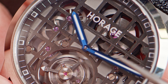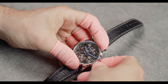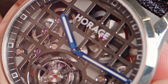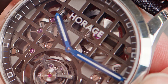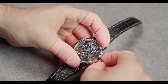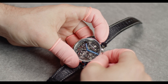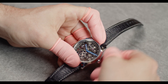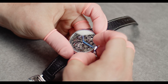Now the watch is fully wound and you can see that the mainspring will skip little gaps in the barrel. This prevents a breaking spring, which is quite unusual for hand-winding systems — only for automatic systems — but we did that because of the danger of breaking the mainspring. You can hear it, but it's not very noisy and you can feel it. When that happens, you know the watch is fully wound.